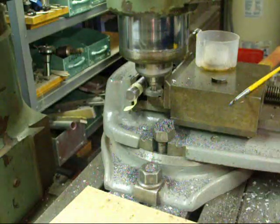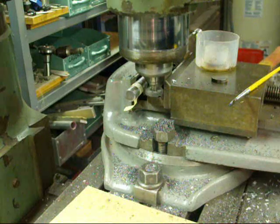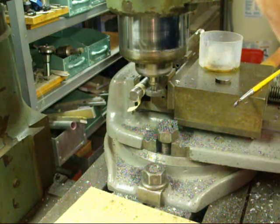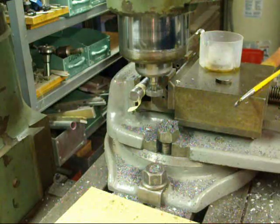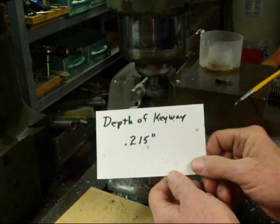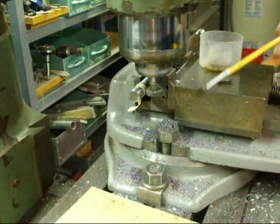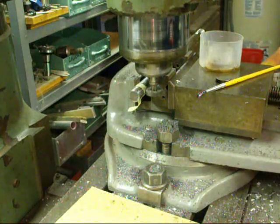Now, since this is just a sample piece, I'm not too concerned about where the keyway is located in the shaft as far as in and out, but you will need to locate that too — it might be an inch from the end or 3/4 of an inch, wherever you want it. Similarly, I'm going to come in until I touch the tape, moving the Y-axis in until the tape is touched. That is done, and now I'm zeroing out the collar. All I do is feed in the Y-axis 215 thousandths — that dimension was found in the machinist's handbook for that size key and that shaft. I'll put a little bit of oil on this. This is a plunge cut and it won't take very long because you're just going in 215 thousandths, and I'm using my digital readout for that, though you could use the graduated collar as well.